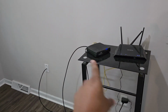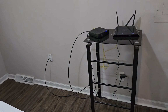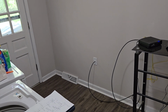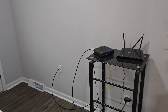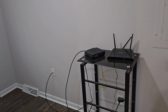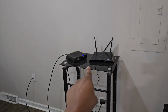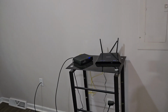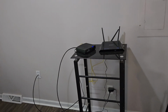The whole goal in adding these guys into the inside of the cabinets is so that all of these wires that you are seeing are hidden, as well as the devices themselves. So with that being said, since you are having your electrician coming in, you may consider relocating them so that they are, for example, at the top of the bottom cabinets, or the base cabinets, closer to the top area of them, almost 30 inches or 24 inches off the finished floor. That way you can have all of these items on that top shelf. You can also plug in all these items inside of one cabinet instead of trying to span them across two or more cabinets, just like what you are doing right now.